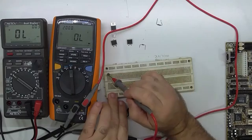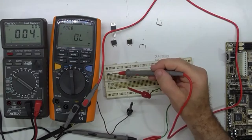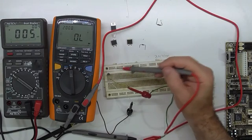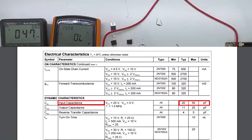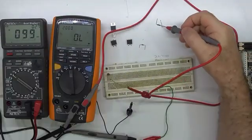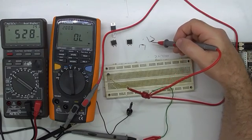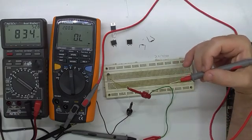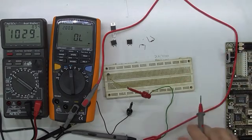Yes — I've just touched the gate and it stays on. I think it was the 2N7000 that has a gate capacitance of about 50 pF. The 2.2 megohm resistor would discharge that very quickly. And you can see it's self-discharging now anyway.